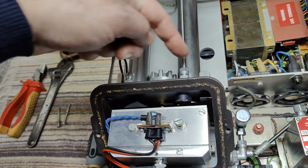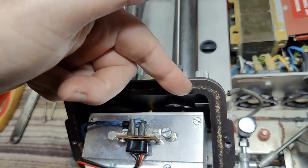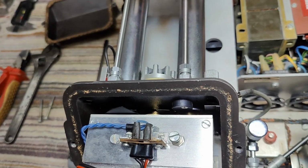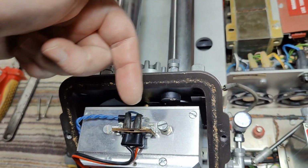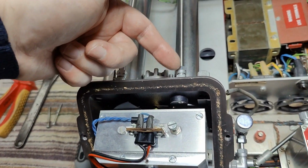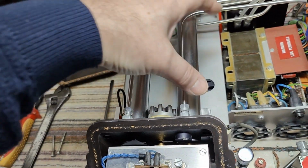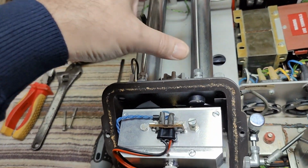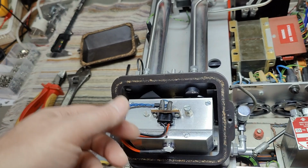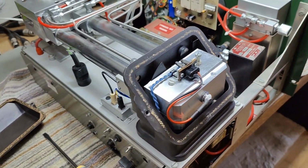And you got different samples in these two. So there's probably a little glass or something down here in one of the ends that will allow light to go through, but not the gas. Obviously, you want to stick it into the sample, so it's pumped through this, and the other sample is here. So you have the A-B type of sample. So it's an optical detector. So far, so good. Now we know a little bit more.